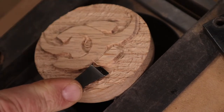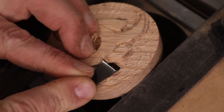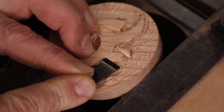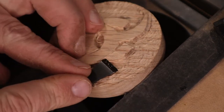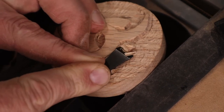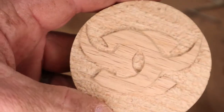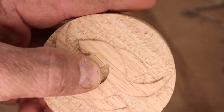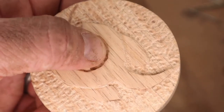Using my new Flexcut chisel, I'm pushing back the rear C — the one behind the top one — to give it some depth and dimension, just taking a little material off to push it further into the background on all three areas of that underlying C. This gives it a little extra cool factor. Also off camera I stippled the background with my pointed cut bit to give it a little texture and make that brand stick out more prominently in the foreground.